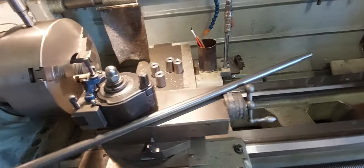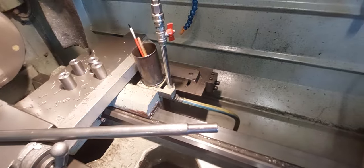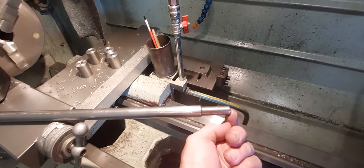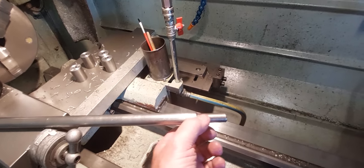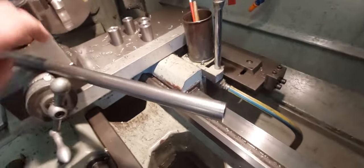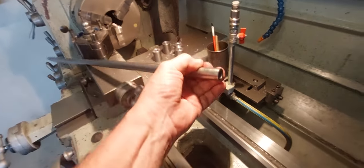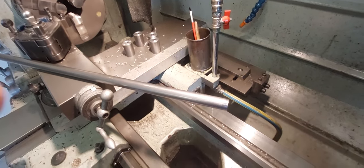The best thing to do is have one end machined down for your smaller material — turned down on one end, square on the end, so your parts are just sitting against it. Have a turned-down section for your smaller bushes. On the other end there's a drill and tap hole — a thread in that end. So you've got a square end on one end for larger bushes.